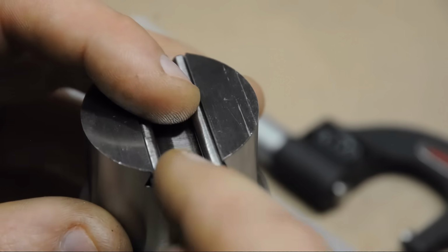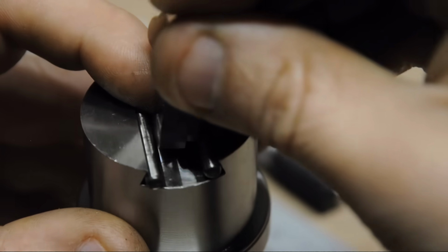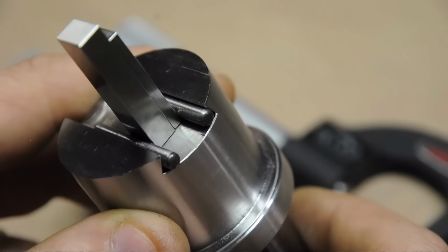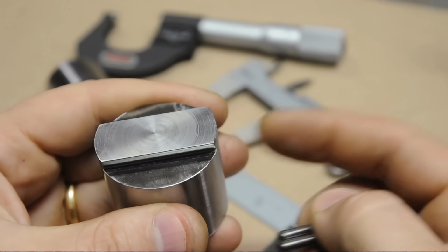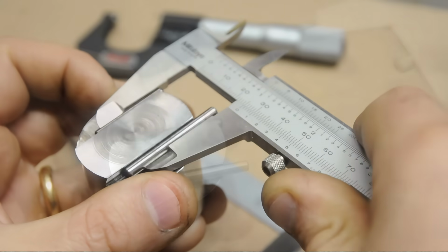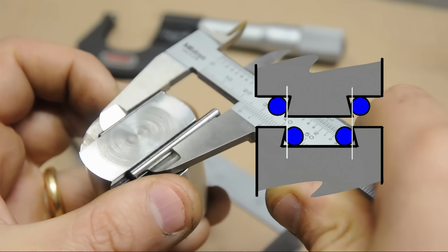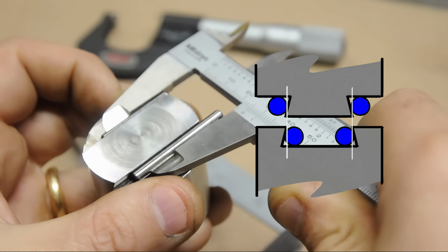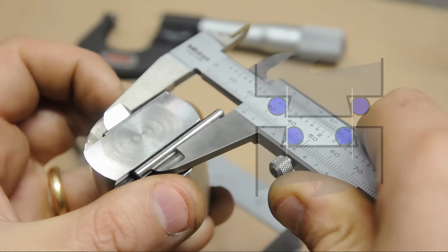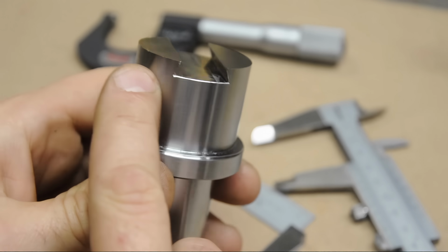Drop the pins in. Make sure everything's nice and clean, and try to do a good job taking that inside measurement. Use a couple of gauge blocks to pick up that inside measurement. This now gives us our baseline nominal to cut the male dovetail to. Then as you're cutting the matching dovetail, you can occasionally drop these pins over and take that measurement. When you're measuring the outside like this, you'll want to add 2 more pin diameters because you've moved from an inside measurement to an outside measurement. But if you sketch it out on paper, what you're trying to measure with the dowel pins will become obvious. Now we can go back to the mill and start to build in sort of that hybrid gib/dovetail.